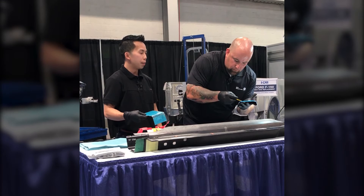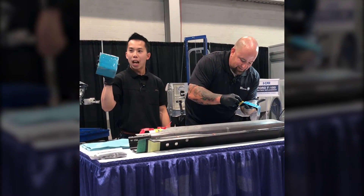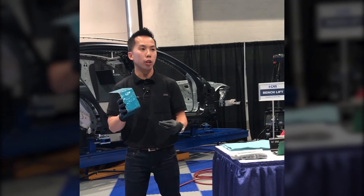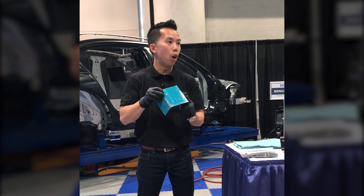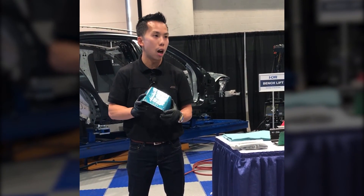We're going to do some TV magic and actually have a piece that's completely nice and thin, applied. The key thing is you cannot put wet glue on wet glue. So we actually have to cure the K1 — nice and hard — and then we can apply the K2, which is our carbon glue, over top of this.